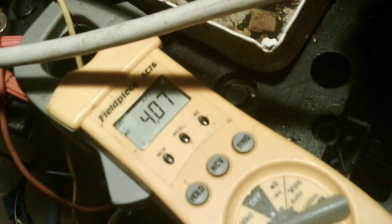On the refrigerant side, we basically took out the coil that used to sit right here — that would be sitting outside of your house. We added a filter dryer, added some service ports, took out the exterior fan, and then added this heat exchanger. When this thing is running — maybe you guys can see the gauge — it's pulling about 4.1 amps total at 120 volts, which is very doable on solar.